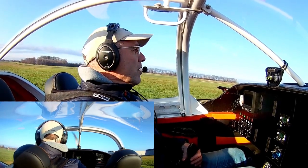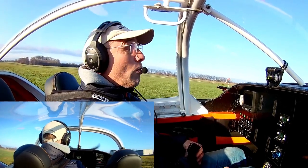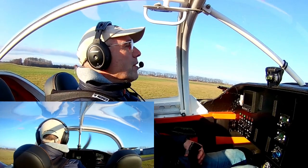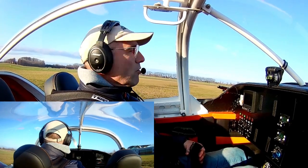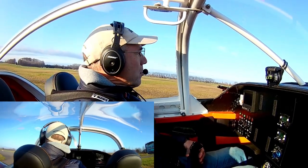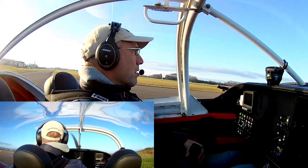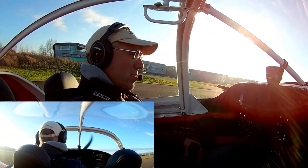Okay, so it's really close to my hangar, so not much time to heat up the engine, I guess. I will do, let's say, a slow run-up. Because the run-up is actually very fast, because you miss all kinds of controls, as they are automatically controlled by the ULPower ECU. So actually, I only need to check the coils if those are okay, and I could check the propeller. So let's do that just for the sake of argument. Mostly the governor, which is electric.